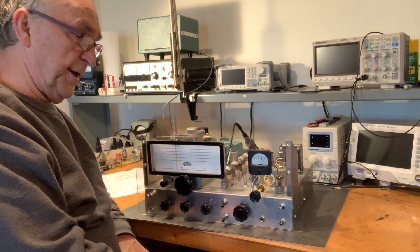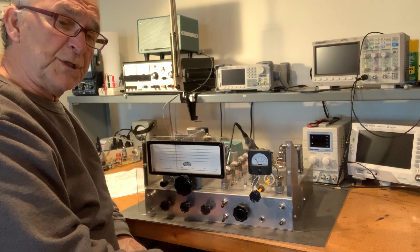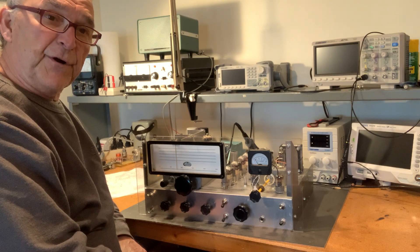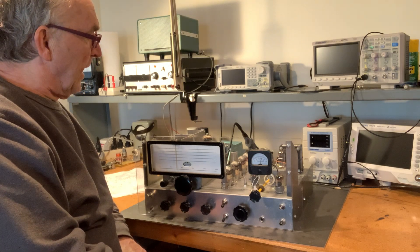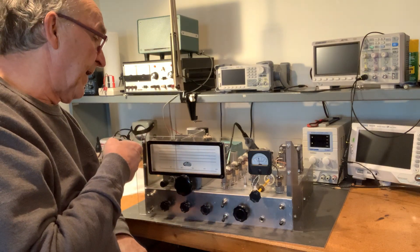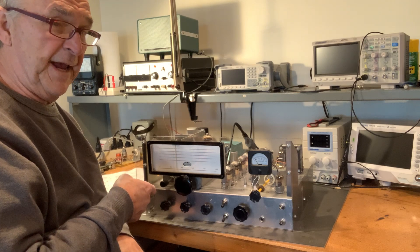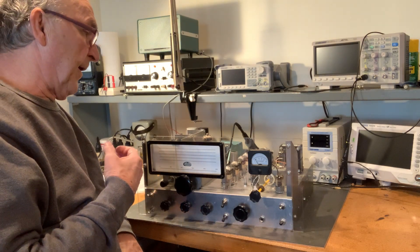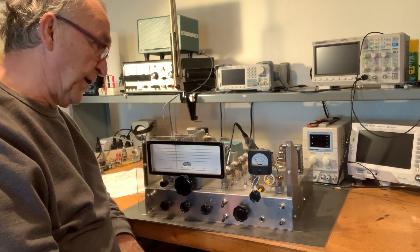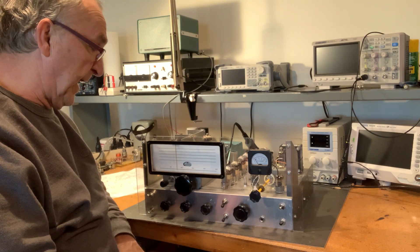It's got very nice audio and plenty of gain. I've been working on a smaller receiver project since then where there was never enough gain, but this time there's plenty of gain because there's an RF amplifier, a first IF amplifier gain stage, multiple second IF amplifier gain stages, and two audio stages — so there's plenty of system gain.